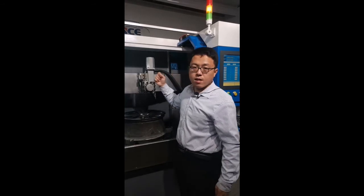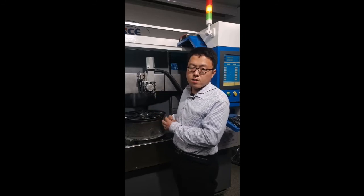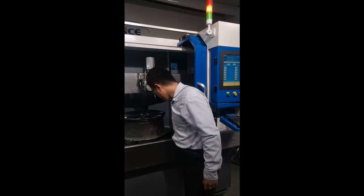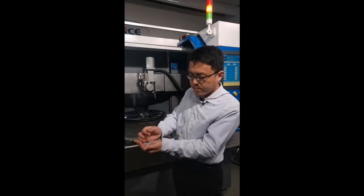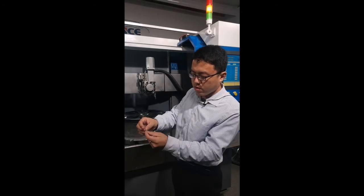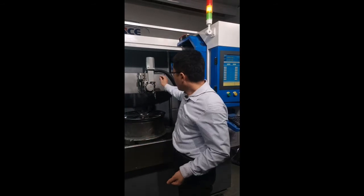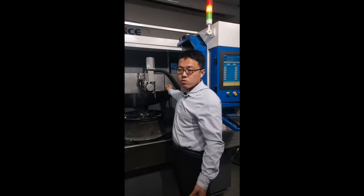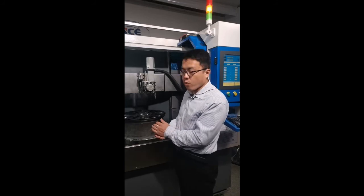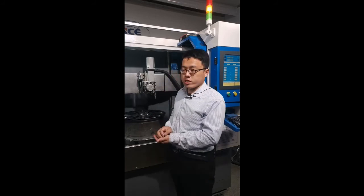Next part is the metal cover. You can see some machines from other suppliers. You can see the guard rail and the screw inside. Why do we add the cover? Because the scrap which is cut off from the wheel is small and very soft. If this material, the scrap, sticks into the guard rail, it will influence the normal work of the machine. So this part is important.